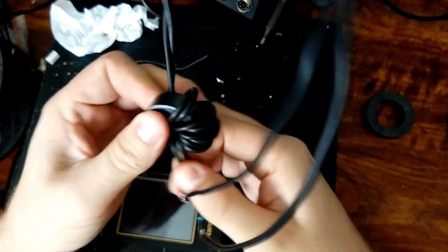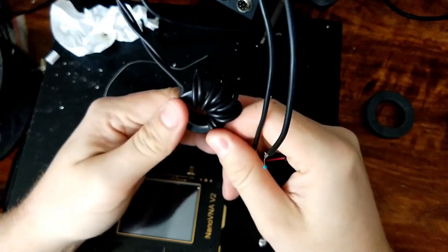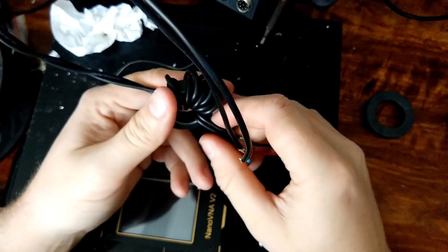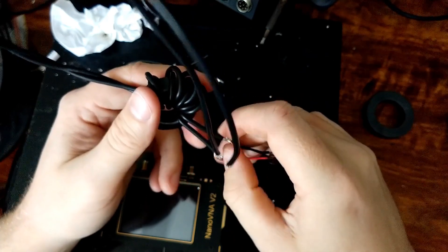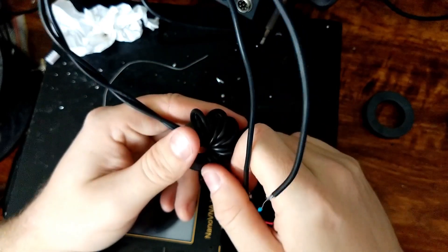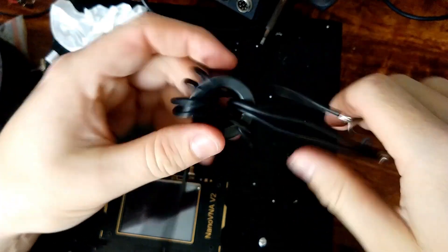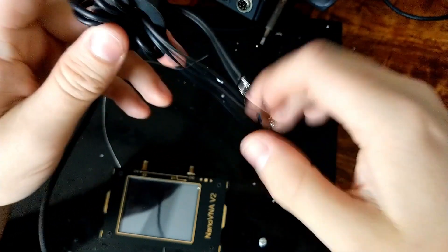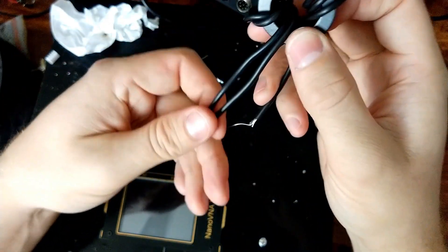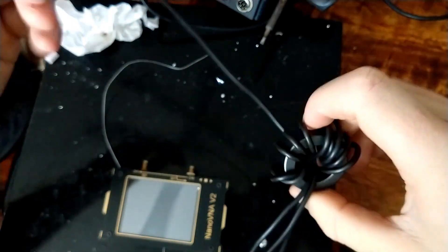I really like off center feds - I really, really do. But I probably need to play with an end fed half wave - they're so much easier to feed. And if you have a squid pole, your squid pole is not going to hold up RG213, and that's all I've got at the moment. You can't really center feed the antenna - off center feeding drags it down a little bit to the ground. I'll try end feeding - I'm mainly interested in 40 meters, and this transformer tested okay on 40 meters.